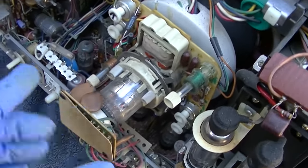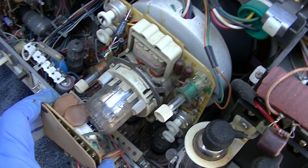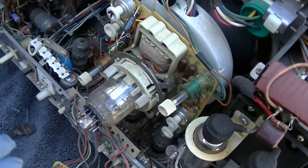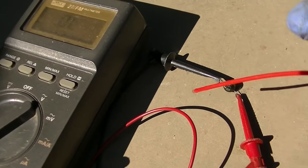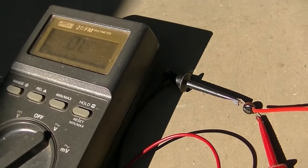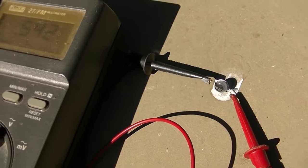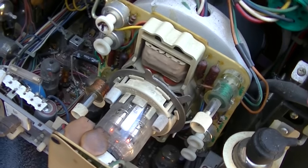So I guess now that I've got a solid diagnosis — it was a bad diode — I can get my resistors out of there because it is not that pot. That's interesting — tweaking around with that pot must have changed the load just enough on that diode to get it to kick in. To be scientific we have to repeat it at least three times, so I'm going to spray this thing again. There it goes — two times is good enough. That diode is the fault in this TV.